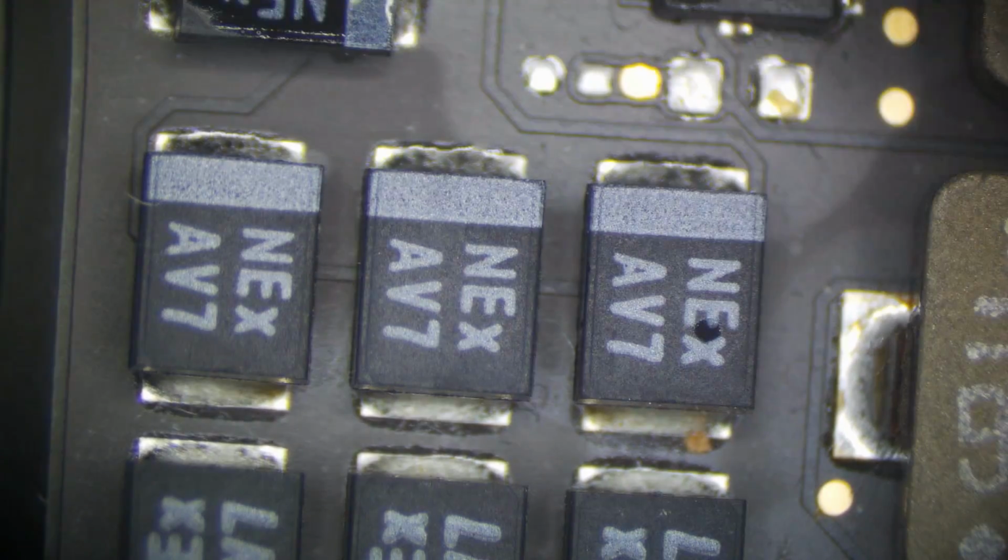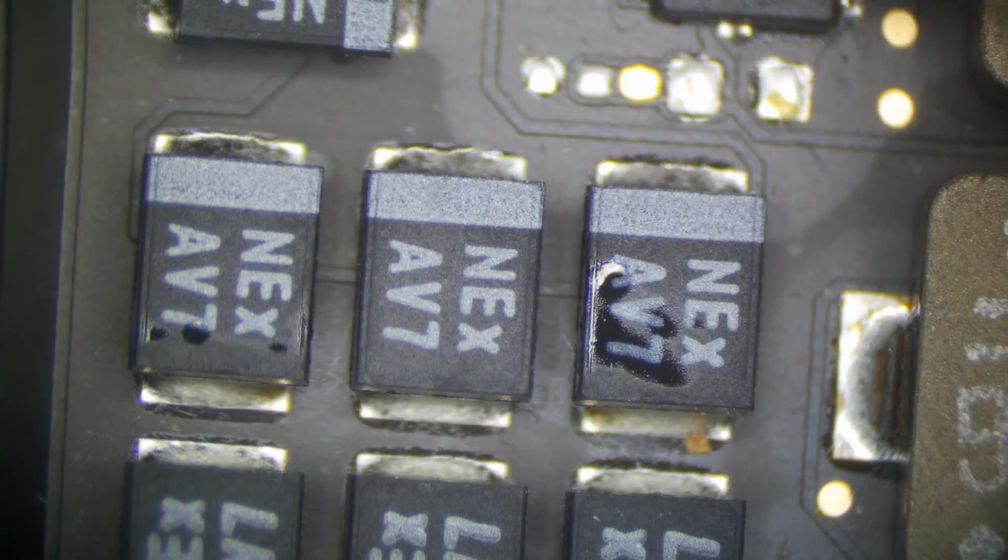Alright, power supply is on. It doesn't want to pull current right now. Let me try a different ground screw. There we go. Alright, which one is it? Is it this one? Alright, it is going to be this one. See how long the alcohol takes to evaporate on here, or on here, or on that one. It is much quicker on that one than any of these. So that's another quick test that we can do. Same with MOSFETs, they're fine. So this cap is our suspect.